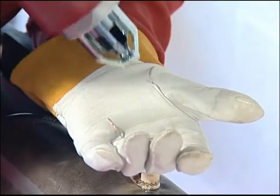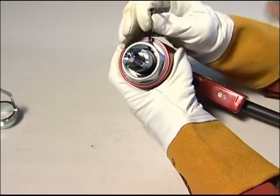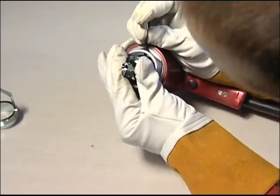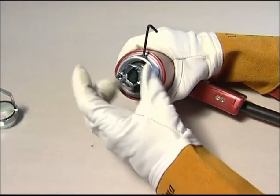This is achieved by firstly removing the ferrule holder, inserting the Allen key provided through the hole in the front piece and into the securing hole on the centerpiece. This will lock the solenoid and prevent it from turning freely.